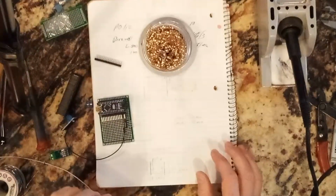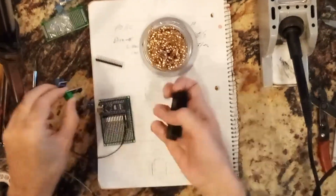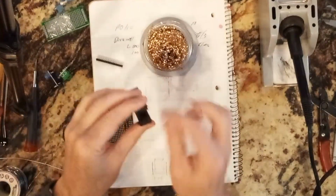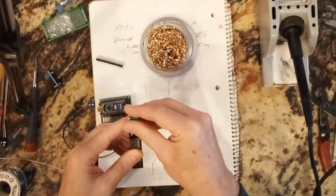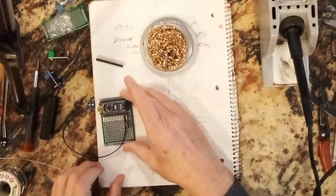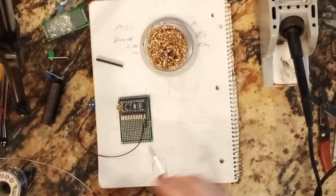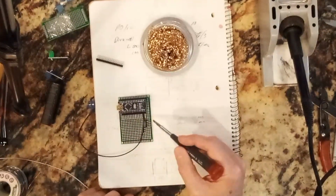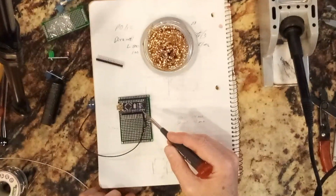All right, so what I've decided to do is I'm going to put these 2 little boards off to the side. This prototype needs some adjustment. So I have another one printing that slides down in there, and then I can mount them off to the side. And then what I'm going to do is solder these angled header pins on here, and then I'm going to collect the ground and the 5 volt.